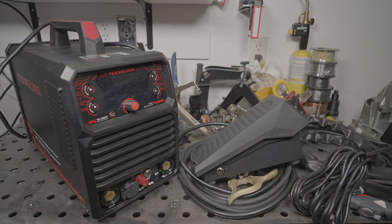Maxed out in AC TIG mode when using a foot pedal, my machine is basically limited to 1/8 inch aluminum. Aluminum draws heat away so fast that it takes a lot of amperage to quickly make a puddle without overheating the entire piece. AC TIG simply requires a lot of amps for aluminum, and even at 180 amps you'd probably struggle with anything over 3/16 of an inch in many situations. In DC TIG mode it also outputs less with a foot pedal, but the difference isn't as dramatic, probably because the output is higher in the first place.